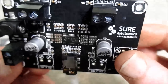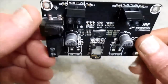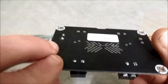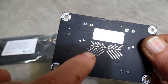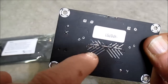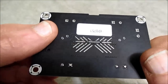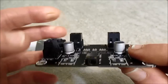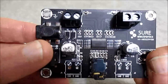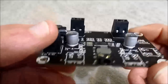It is small — it fits in the palm of your hand. There is no heatsink; it's a very tiny chip. Though I do see effort on the back of the board — there are all these little vias and soldering lines. I think it's all about trying to dissipate heat from the IC, because it is very small and there is no proper aluminum heatsink. So I am concerned about how it can dissipate power with 4 ohm loads.